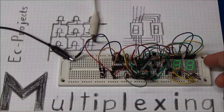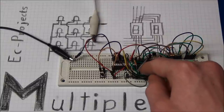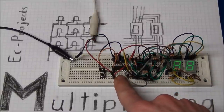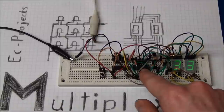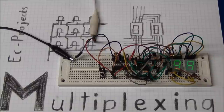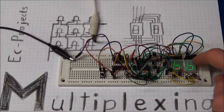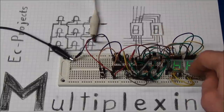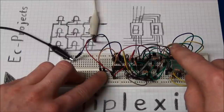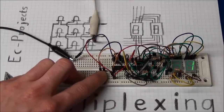And in the end we will take a look at the code I used to drive these displays. I am using a 4511 driver chip, so the signal coming from this microcontroller will be a binary coded decimal. The 4511 will translate that into the 7 segments, so that can be displayed on these 7 segment displays. I am simply using a transistor to switch in the ground for each display when that display needs to be updated. So the transistors will alternate and switch in the correct display.